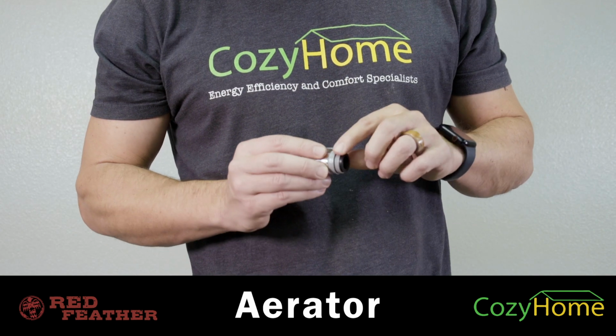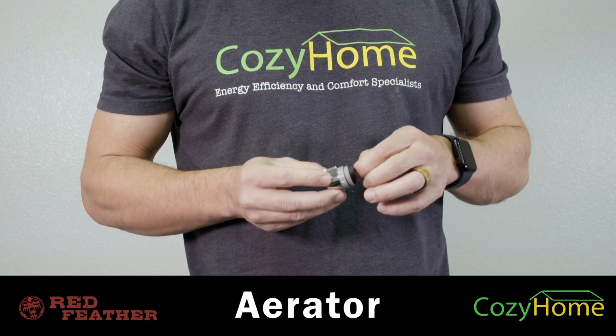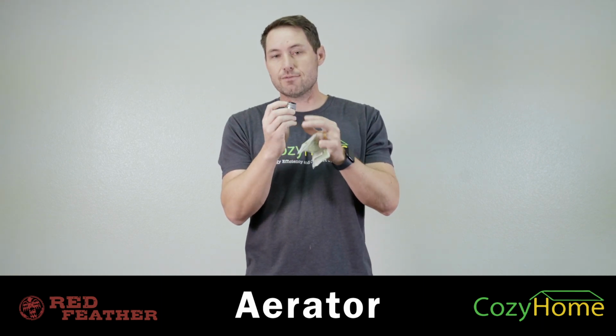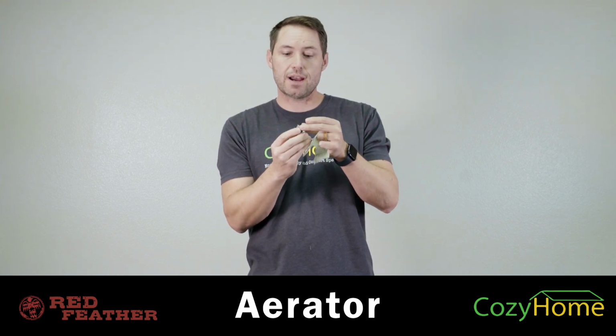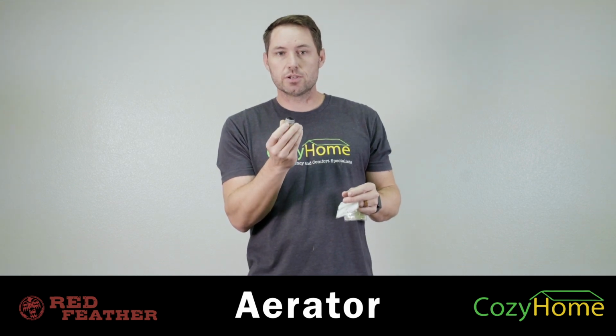They have little gaskets here that come with them. So to take the old one off, sometimes you might need to use pliers again to do that. You just want to make sure that you're not forcing anything too much. And once you get the old one off, you can just screw this one back on. These have really fine threads on them, so you want to make sure when you're putting the new one on that those threads don't get cross-threaded. Just be real, real easy with it and then slowly screw it on. And if it feels like it's starting to bind up, maybe back it out and try it again.